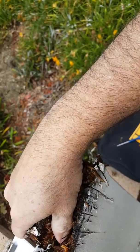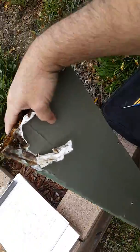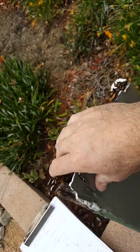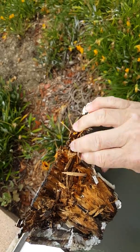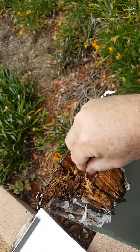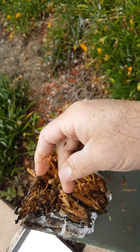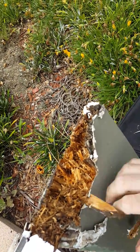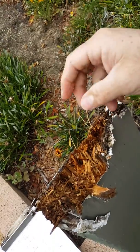You can take a piece of fascia board and see that this is the front of it — it looks nice. But once we start digging at it and finding the source of the damage, you can basically just rip it apart with your hands. There is absolutely no possible way this should ever be filled. This type of fungus damage needs to be replaced every single time. The source is water intrusion — it looks like where they put the seams together they left too big of a gap, and water got in there. That's what happened here.